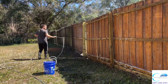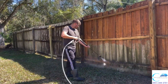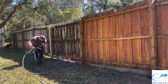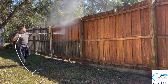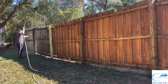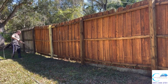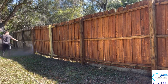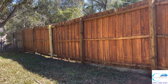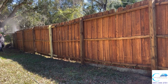That's actually what I'm doing right here. What I'm using is called an X-Jet. An X-Jet is an incredible way to apply chemical if you don't have a soft wash system. The rate at which it applies chemical is usually a two-to-one ratio — two parts water, one part chemical. There are different mixtures for different things. Sometimes you want a really hot mixture, meaning a high percentage of sodium hypochlorite. Sometimes you want a low mixture if the job isn't too dirty — maybe a 1% to 2% sodium hypochlorite. You dilute it with water to what you want and shoot it out the X-Jet. It can shoot super far, so I'm able to clean sides of houses, roofs, and driveways with it. This thing is just so versatile.